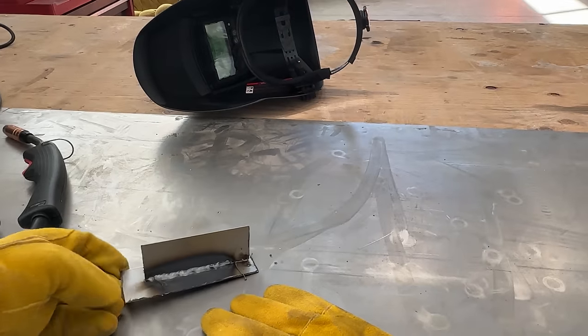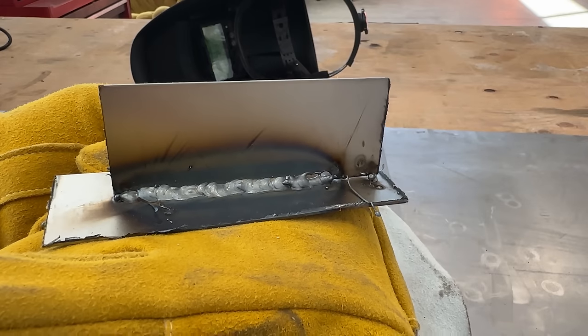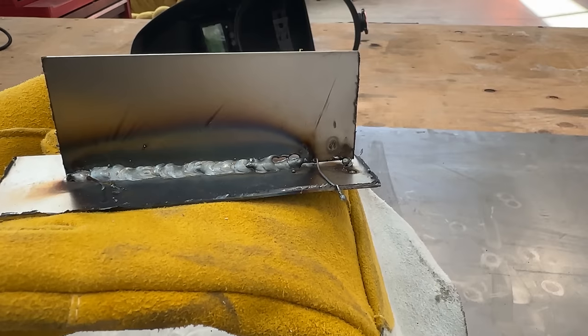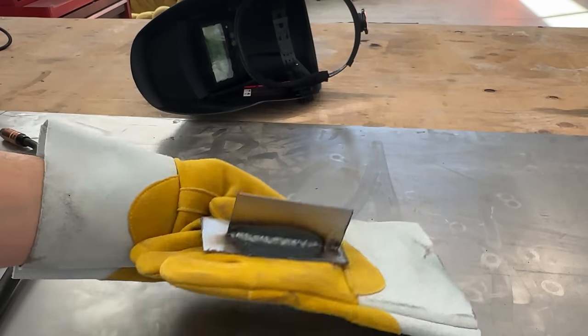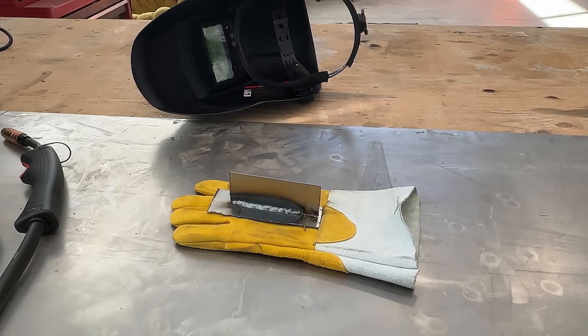This is hot. So it starts, the puddle goes and it's moving, but then it gets super, super hot. And right over here, it blows out. So, from the videos I've been watching, you gotta go slow, you gotta go on different sides. You start here, do a little bit, start there, do a little bit. Keep practicing.